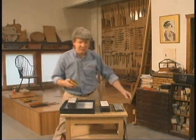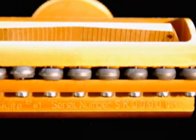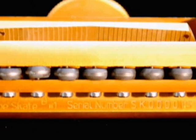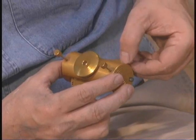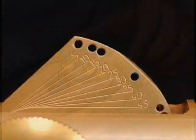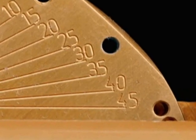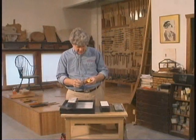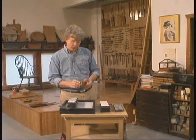This is fun. I'll have to show you how it works. What it is is this cylinder with the skate wheels right underneath it. It's got little axles holding all the wheels and a big hold-down screw. I added these little pin guides out on the ends — they pop right out of there and then the hold-down will spin right inside the guide. It's got this angle gauge right in here and you can put a skew chisel in it, put a skew turning tool in it. You can even pin it right down in the corners at 18, 22, and 28 degrees so that a skew chisel will fit right inside.